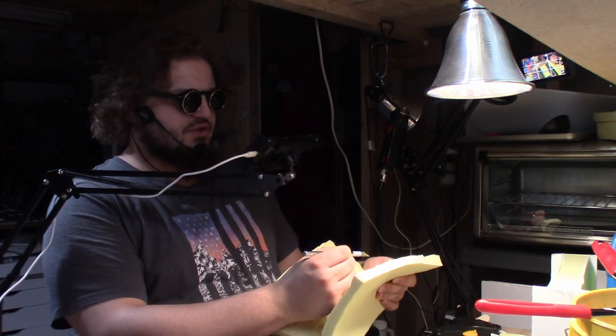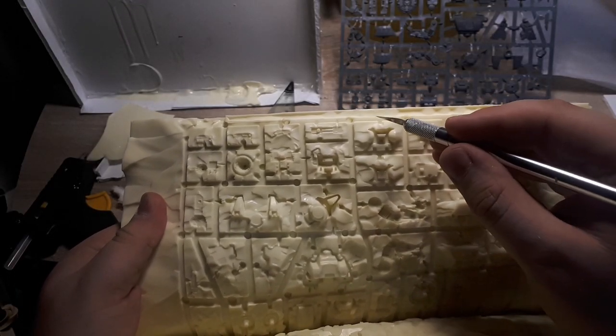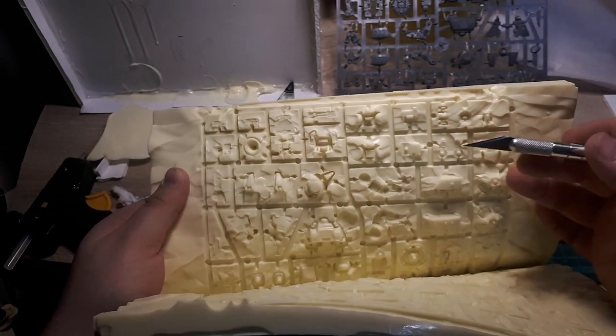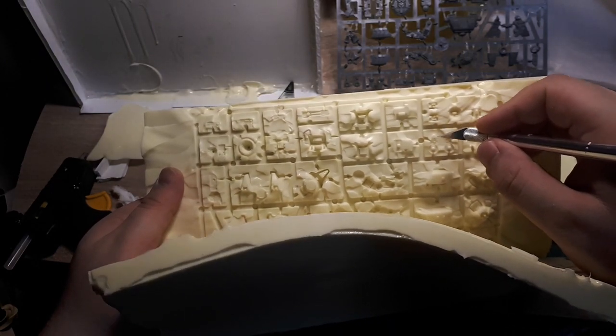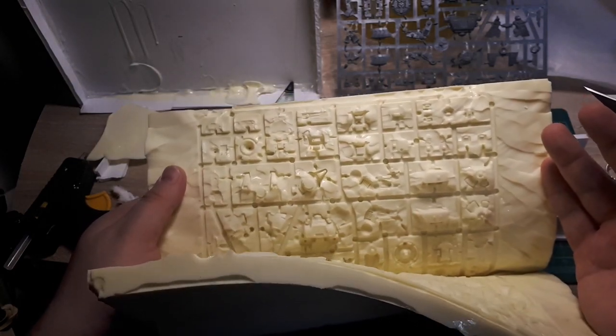Even though I have done a lot of experiments with these molds, I never really thought of creating my own air vents before I create the mold. Prior to this, I would usually just take a knife and cut additional air vents wherever I saw the bubbles ended up forming. All I've done was make a pour, take out the plastic, see where the bubbles have formed, and just go to those places with a knife and add additional vents manually. But this was done after the mold has already been made.